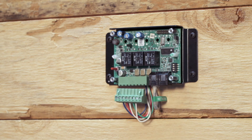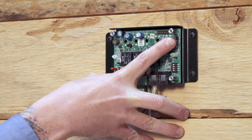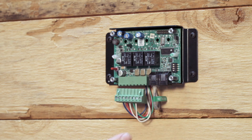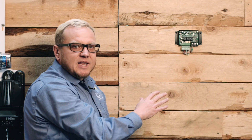If we take a look inside of the AGS, there are a couple of things we need to note. The two things we really want to look at are this voltage jumper — we've got this set for 48 volts — and then these four dip switches down here, which we'll get into in a little bit. They control the three relays inside that dictate how the AGS is going to perform and interact with your generator.